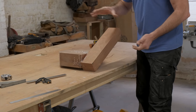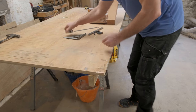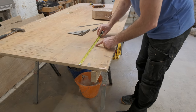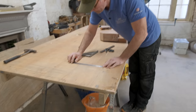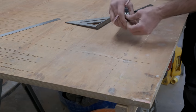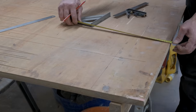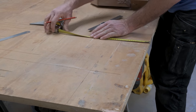Because once I set this, I know I've got everything perfect how I want it to be, guys, okay? So the first measurement I want to do is 303, then 303 there. I then measure up from top of tread to top of tread. It was 175. Let's make that measurement off that ply. It's 350. This is lovely. So we're going to go 350 here, like that.